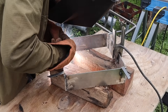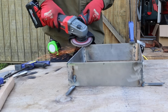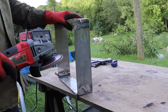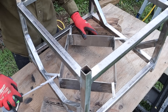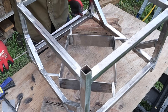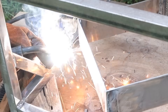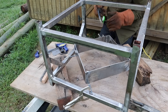After those brackets were welded on each corner, I cut off all the excess pieces sticking out and ground down any rough edges. Then I took my time measuring the middle of the base because I needed this square box to fit right in the center. It also needed to be a diamond shape — diagonal — because of the way the burner was mounted. I used clamps and measured out exactly where I wanted it. The middle box almost looks like it's floating, but it's welded on with those metal brackets.